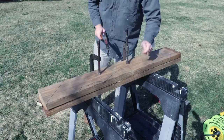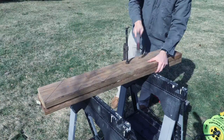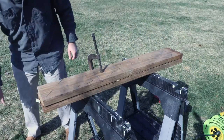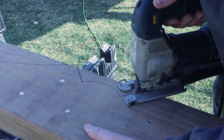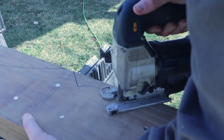Fasten the boards together using about 10 10-penny galvanized nails or decking screws, keeping the fasteners within the pattern you traced. Next, use your jigsaw to cut the pattern out. Since you're cutting through 3 inches of depth, you will need a longer jigsaw blade than typically used — in this case, a 5-and-a-quarter inch long blade.